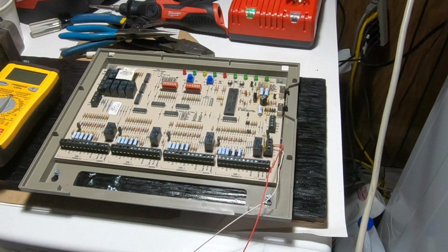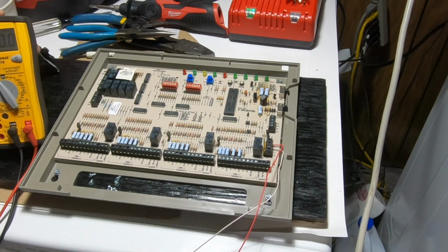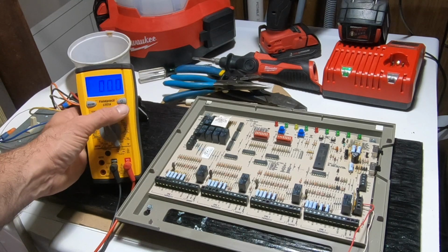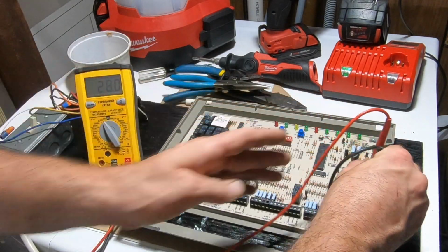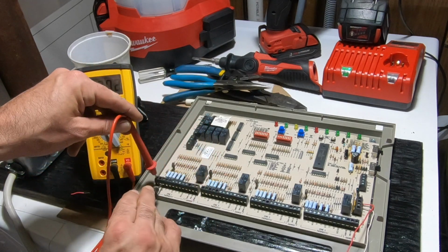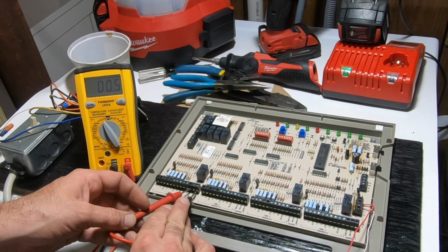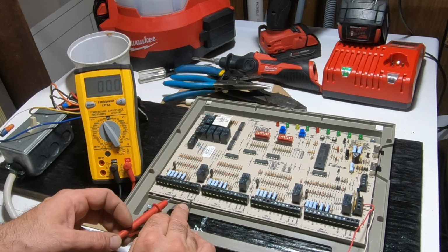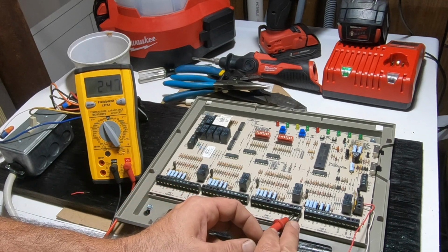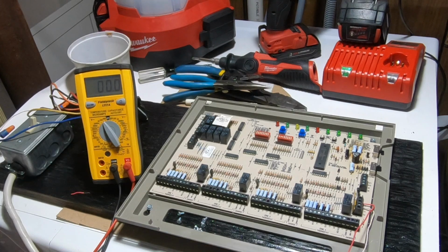let's see what we get here. And as I watched the last video, the blue actually makes it harder to see my meter. So R and C is going to read 24, 25. Now we have nothing over here but R and C. I'm going to have to get new power there. Now, 0, 0. Got power there. This is power for my open and closed. So right now my damper's wanting to be open. Damper's energized to be open. This damper's energized to be open. So right now all my dampers are energized to be open.